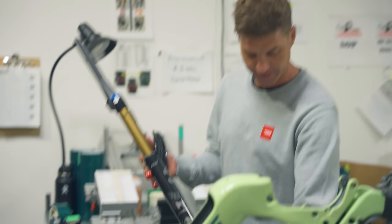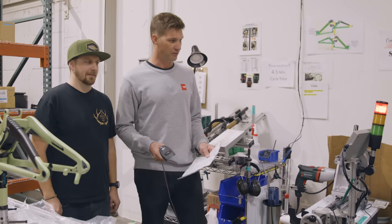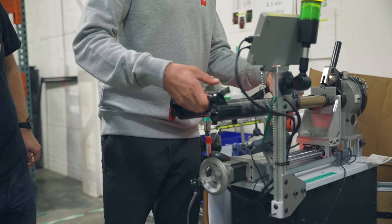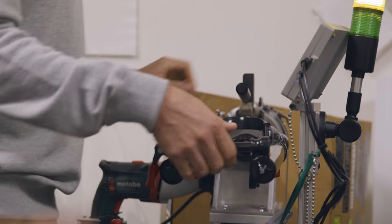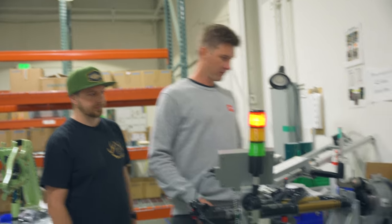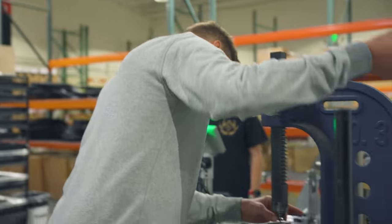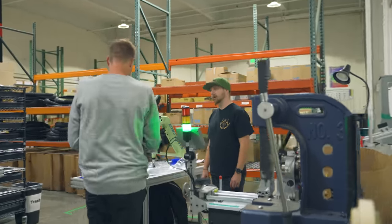Back in the bag — not quite yet. We're going to sit back there and get ready to cut the fork to the right length. It will self-adjust when it wants to. Clamp it down, and we're going to hit the cut fork button right on that screen. Now pop that back open and we're going to insert the star nut. The fork is done and ready to get put back into the bag — we'll install it in another station later.